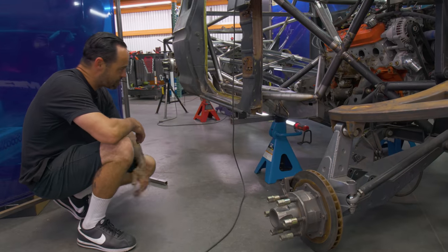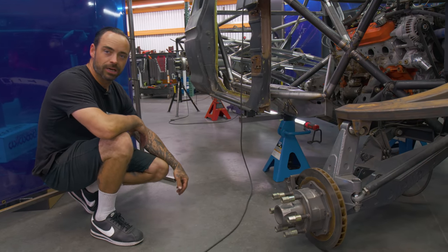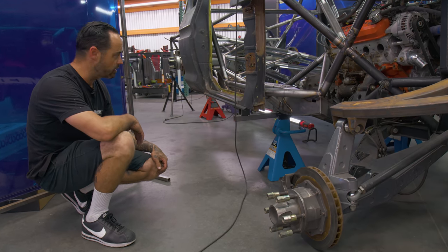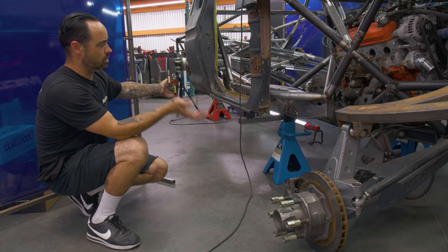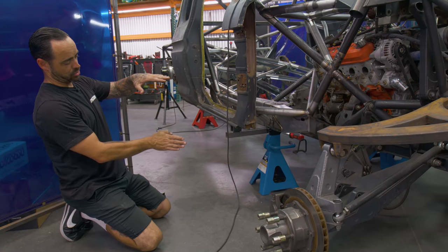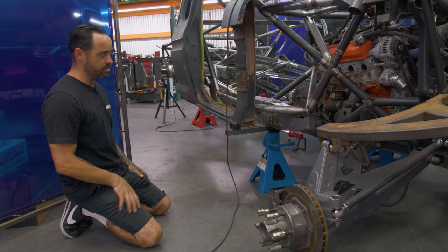When I was in high school, they used to have a lot of mini trucks and street trucks. Part of that program, a real sick way to get that thing low, is to body drop it. And I'm sure they do it with a lot of C10s and stuff now. Body dropping is essentially, these trucks are body on frame. So if you body drop it, you're scooching your frame into your body, and that's lowering the whole car overall in the exterior.